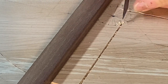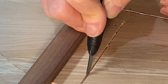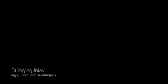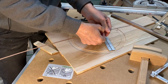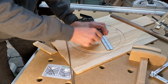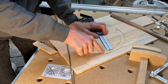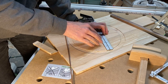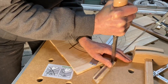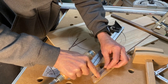Come through with a chisel and clean out the extra material. I've already cut my inlay and beveled the edge so that it will lie nicely into the groove. Each of my spokes I need about a 4-inch piece that will do more than enough. I'm going to start it at the inside edge and let it extend out past the outside, then cut it to the exact length inside this groove that I need. So I'll cut a couple off at 4 inches. Right now I'm doing just 4 grooves so I'll cut 4 pieces so I don't lose track of where my parts are.